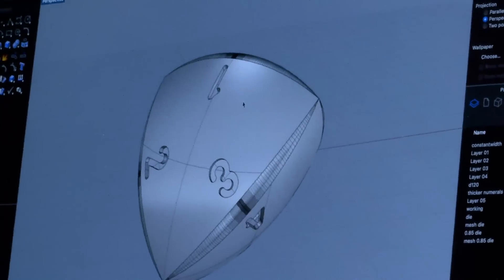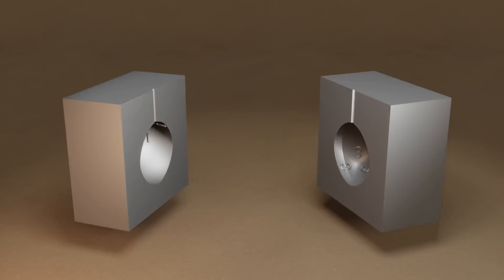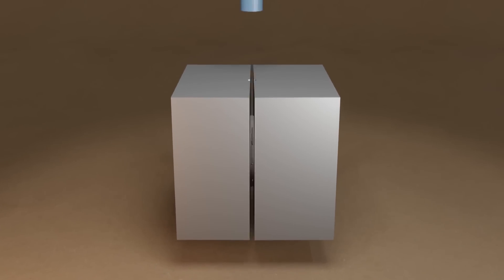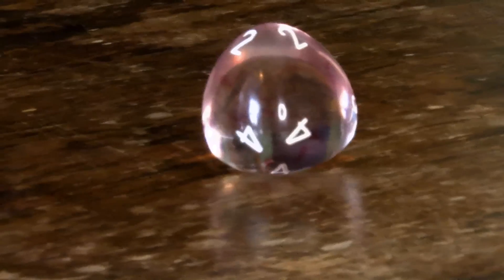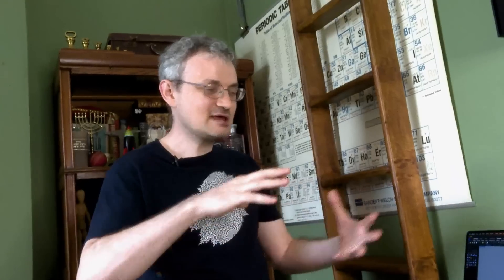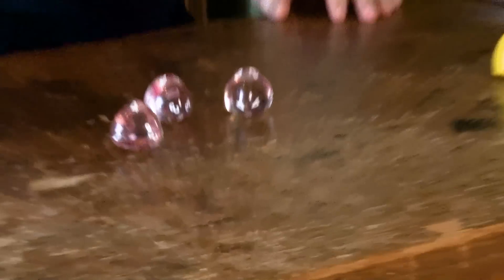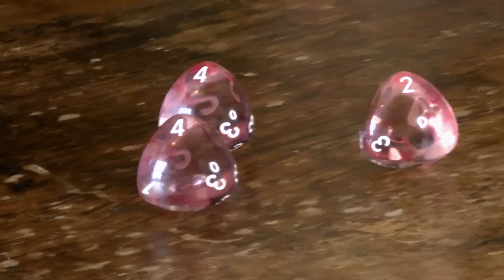There's another problem to solve. When you're making dice for mass-produced injection molding, the mold comes together in multiple parts, the plastic squeezes out with little bits of rough stuff, and they put it in a tumbler to smooth out imperfections and make your nice shiny dice. The problem is that the tumbling process is going to do different things to the sharp corner at the top than to other places on the die — the shape would be changed by different amounts in different places — so we couldn't use it. By the way, these are prototypes — a sneak preview. Nobody has ever seen these before.